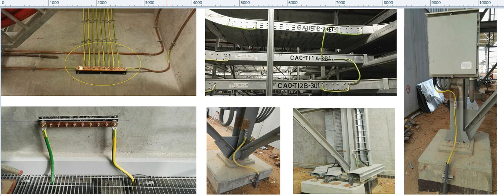In the second snap you can also see this is the copper earth bar, so you can get multiple earthing connections from this earth bar. In the third snap you can also see this is the earthing connection for the cable trays. These cable trays are interconnected with respect to earth connectivity, and here is the metal structure connected from the underground grid to the steel structure.